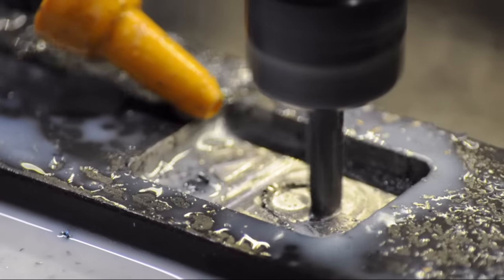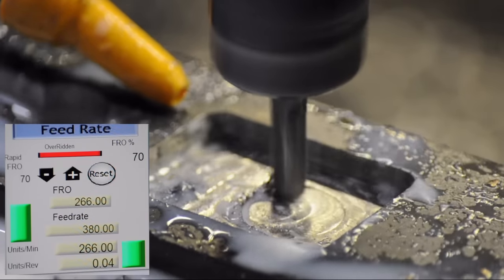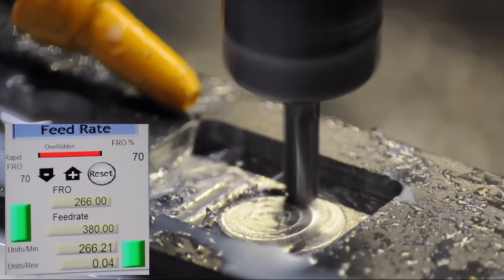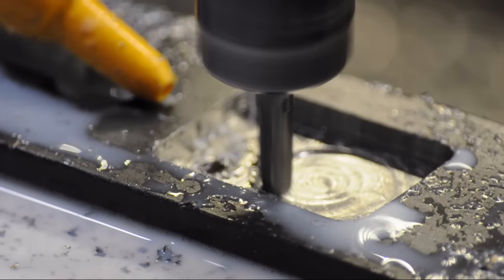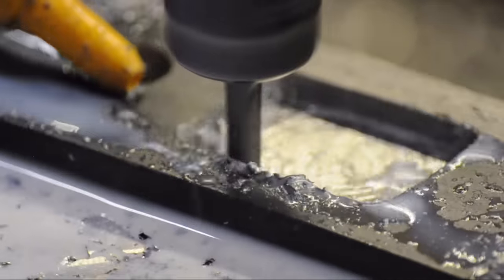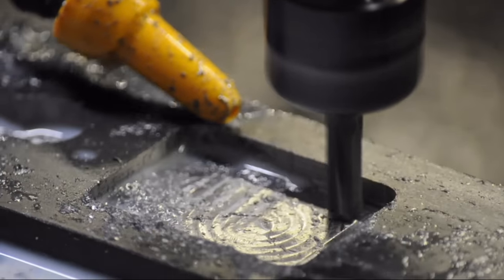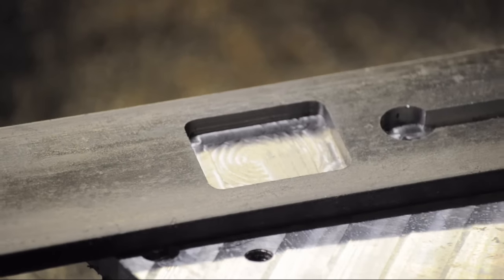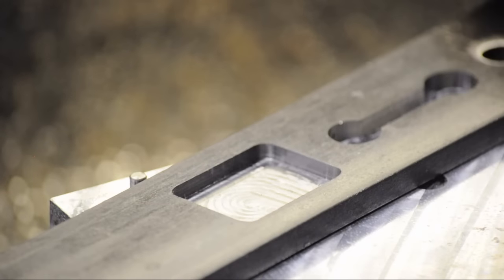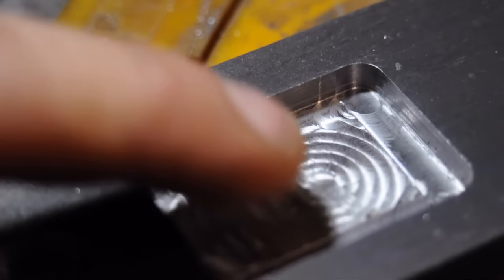This is the finishing pass. Both toolpaths will run at 70% of G-Wizard's recommendation. 70% just felt and sounded better at the machine, and as you can see I'm at about 10 inches per minute according to the Mach display. That dog bone on the right is all pocket toolpath; that dog bone on the left done in about 60 thou step depths. The thought of plunging a 6mm mill that deep really had me nervous. You can see the adaptive is a bit more heavy-handed and wall finish suffered — totally my fault, but I'm learning.